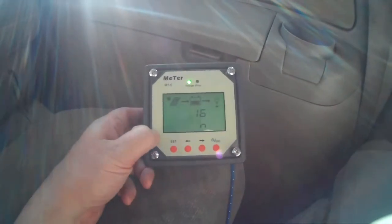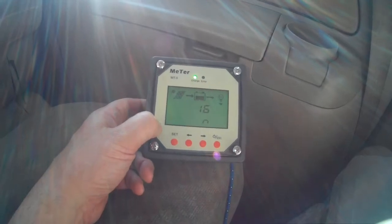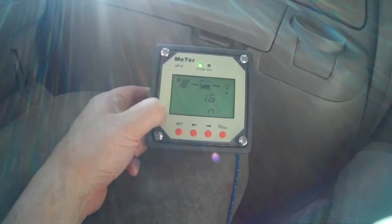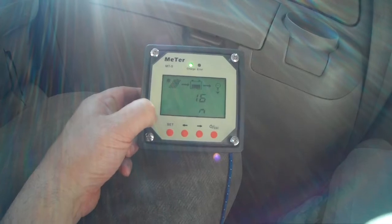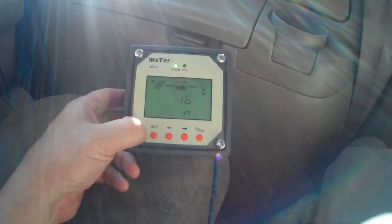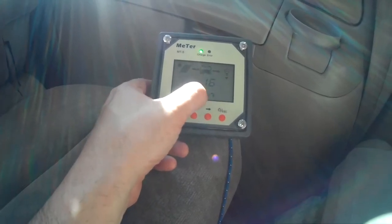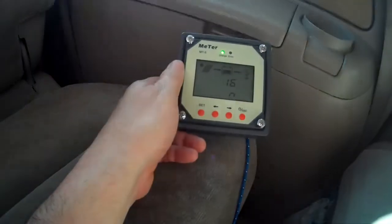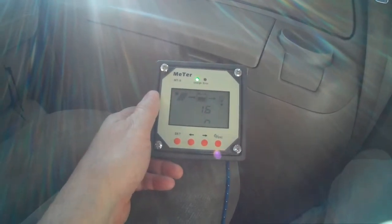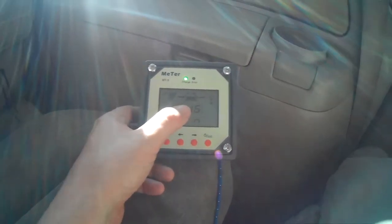You may have noticed on the tracer that there are six terminals: positive and negative for the solar panels, positive and negative for the batteries, and positive and negative for running LED lights. You shouldn't run anything powerful on those last two terminals — they're only meant for something very negligible and they're used for LED lights. You would program when you want your lights to turn on and turn off. Usually when you see a tracer, no one has really connected those — they usually just hook up their lights to their battery.